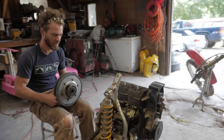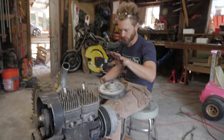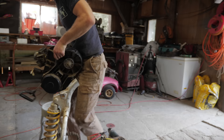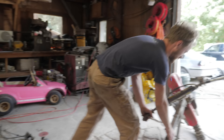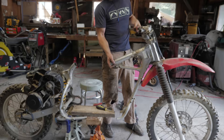The engine sitting exactly where it's at right now isn't necessarily exactly where it's going to go, but I think it's pretty close. The tricky part is getting it low enough and far enough back, because the farther forward it goes the longer it has to be, and if it's too high then the center of gravity is an issue. I came up with one alternative — put the engine back here. The main benefit is it moves the weight back a lot, so the scooter overall could be way shorter. The only downside is the weight would be fairly high, which means it would be more tippy.